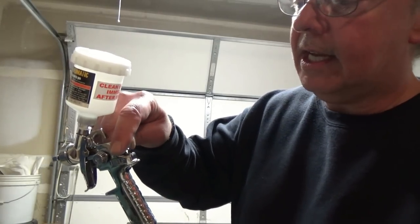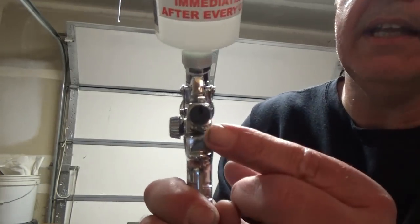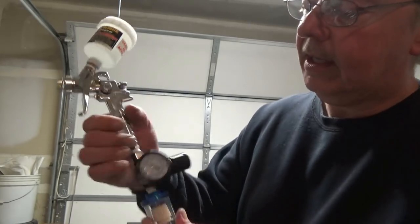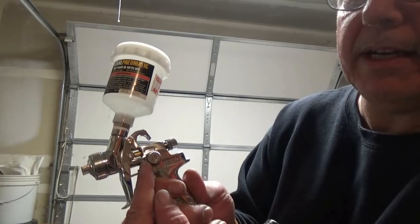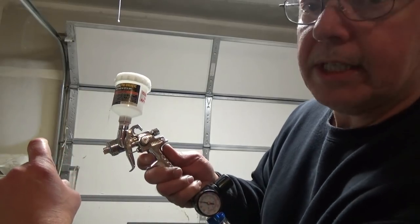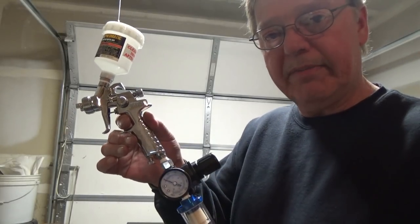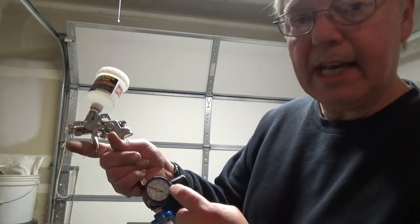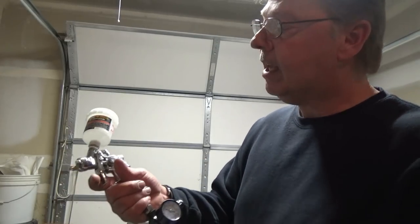Out of the box to set it up: this is your needle — I closed that all the way off, made a little mark to show me where the top is, then opened it one full turn. The bottom knob is for your air and I opened it full blast. The little knob is for the fan and I opened it as wide as it can go. The gun's max pressure is about 45 PSI. I hook up my air compressor, set it at 45, and with the compressor set at about 60 pounds it'll shoot a constant 40 pounds air pressure, which is what we want.